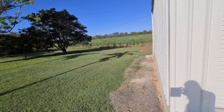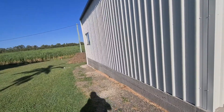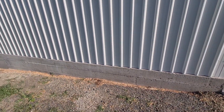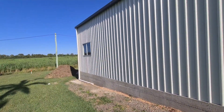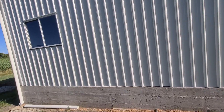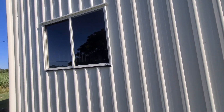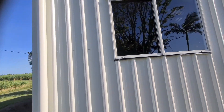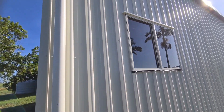I don't like those steel rebates or plastic ones — they look terrible. So we use a rebated system. We keep the sheets three millimeters off the rebate so that you don't have any rust problems or anything like that. You can hose the shed out and keep it all clean. It's all nice and neat, all flashed up.